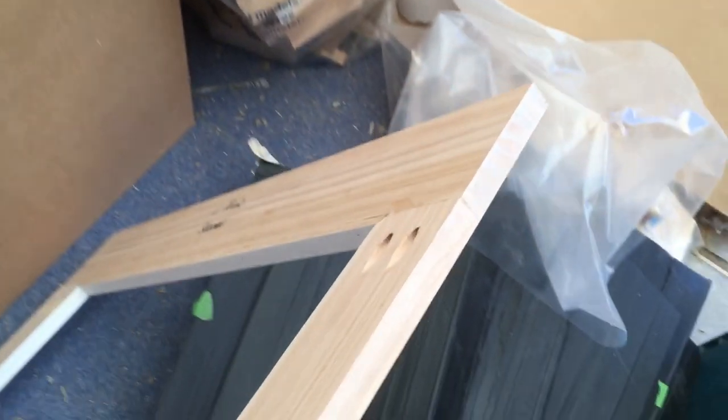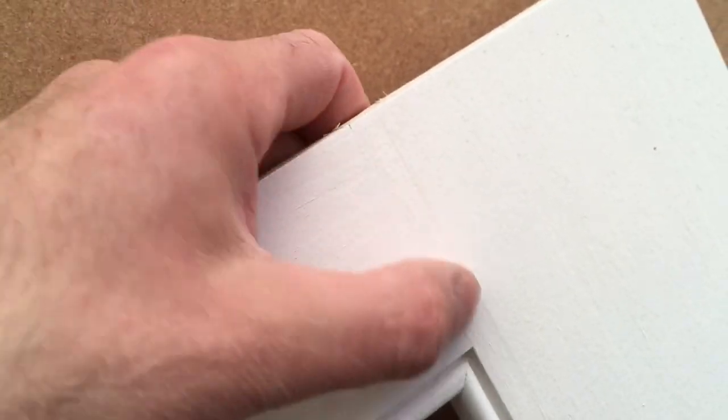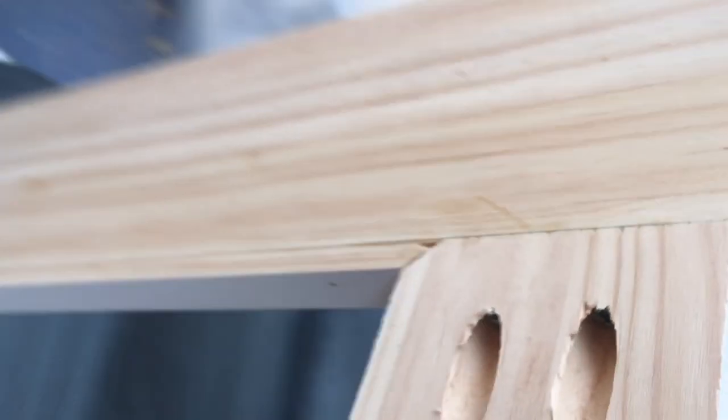Here's one of the other frames. The way we've done that is using a pocket hole joint. The moulding is routed into the upper and lower piece — routed straight into the solid piece. Using the miter saw I did a straight cut and then a little miter cut on that piece. For the verticals, the stiles, I routed and then ripped off that strip so I could simply cut it straight and butt joint it, then pinned it back on. When it's all painted up you've got exactly the same effect.